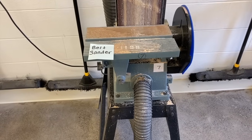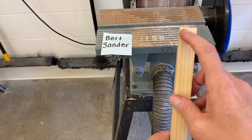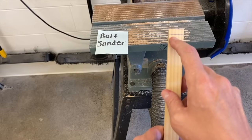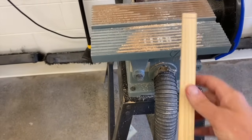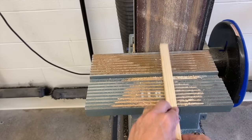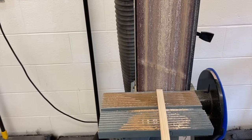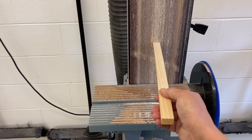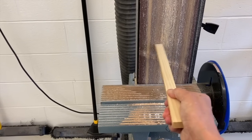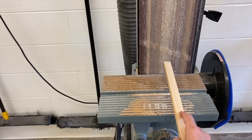Now let's talk about how to sand with the belt sander. In this case, I left a little bit of extra wood so I could sand to the line — it's easier than trying to cut perfectly with the scroll saw. With the belt sander, the belt goes in the downward direction once you turn it on, which means the piece of wood is going to want to slam down to the table. A lot of people will be tempted to sand like this — that's one of the dangers. You're going to lose control because the wood will slam down, and that's when you can get hurt. Therefore, always put it down firmly to the table.